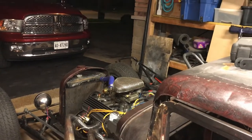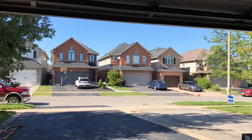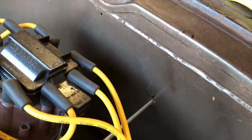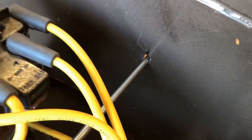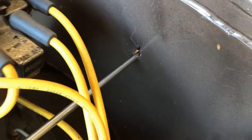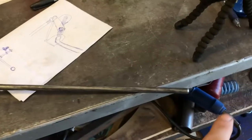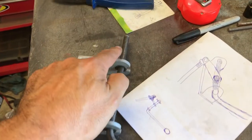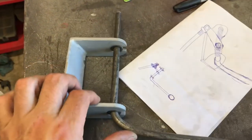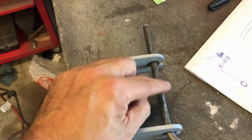Catch you soon — you'll catch me in the next day. Transition. It's a beautiful day, let's continue. I have this side plumbed in through the firewall. The hole's a wee bit tight for now — I'll need to work out how I'm going to make it not scrapey, some sort of elongated nylon ring. So the next step is attaching it somehow to the inside. My original plan was to have this lever coming up from the foot, around here, through there, and then bending up here. But the way it's working out, this is going to sit right in the middle of where the push rod for the carburetor is coming. So I might as well put the lever here.